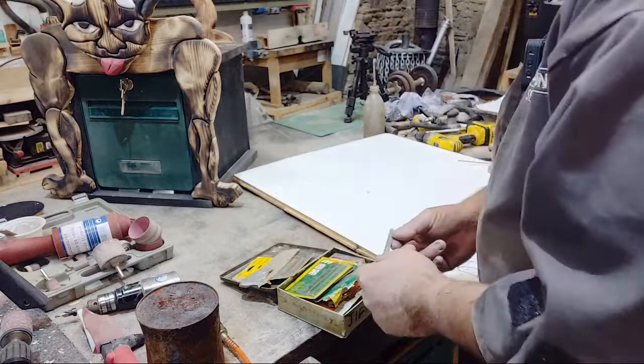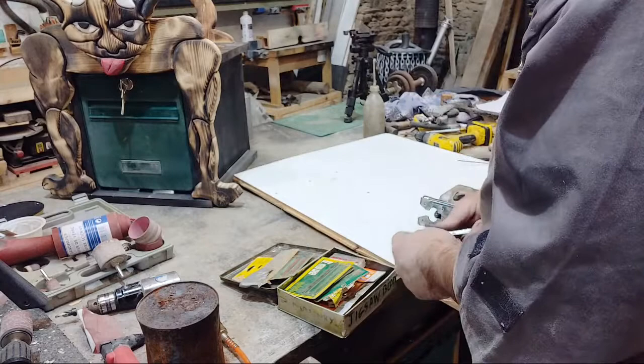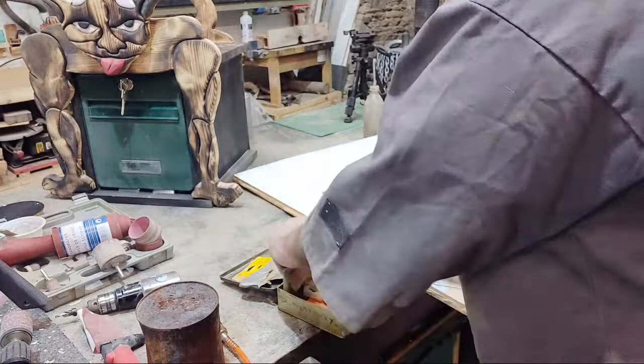One trick you can do is either screw or bolt a temporary piece of wood onto the bottom of your jigsaw. So you can just swap it over quickly, or just put a bit of wood on top, and that way you can make use of more of your blade. As long as you've got that much going through, you'll effectively have a new blade, if it will be tight, that is.